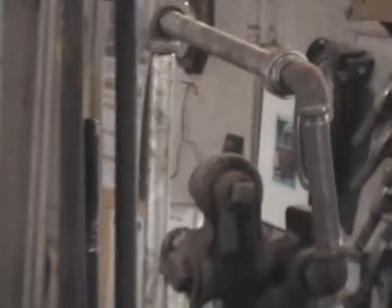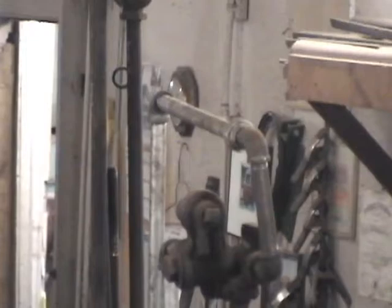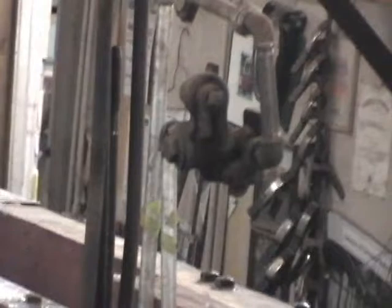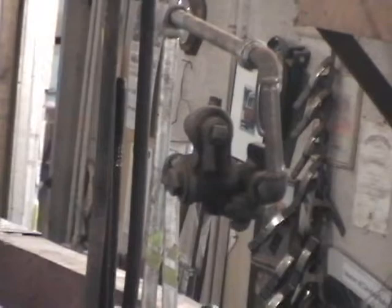The device coming toward us is the feed valve. The actual air that goes through the brake valve is at a lower pressure than what is coming out of the air compressor — it's a difference of 115 down to about 85 pounds, I think. That feed valve is a reducing valve. I'm sure the way it's piped wasn't original. The way we piped it is copying more or less what was there when we found it. I think they put the feed valve inside, right next to the stove, because they probably had some freezing problems with it.